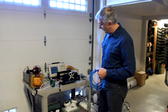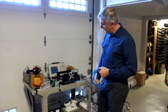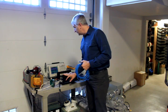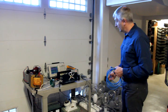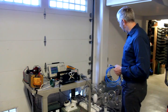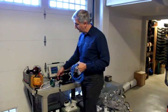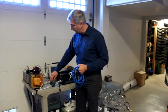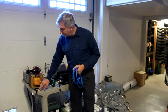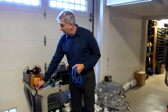To do this, we have a step-up transformer down here that takes 120 volts and steps it up. The high voltage from the transformer is fed into this custom load controller that I built a couple years ago to run HID lighting and reduce the power consumption of standard 1500-watt bulbs used in airports and parking garages. The output of the controller comes out here on these high-voltage lines. We look at it with a current transformer and a x100 probe, and have it fed very carefully into an RJ45 connector right here that's been potted and taped.